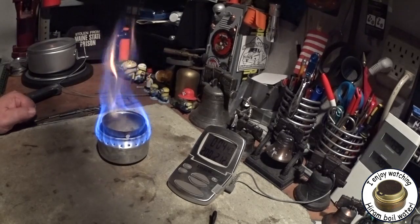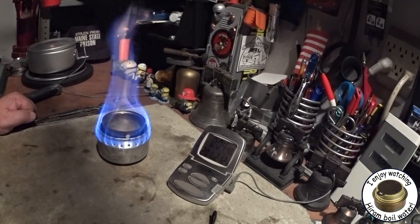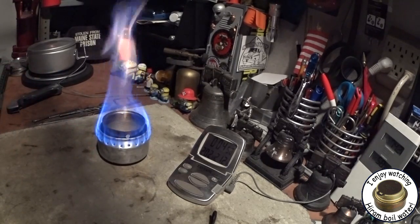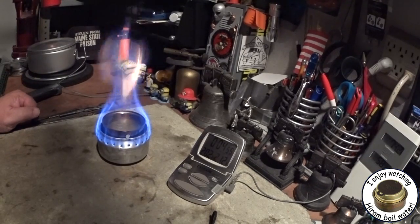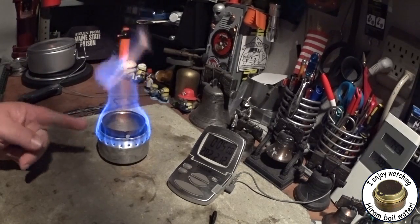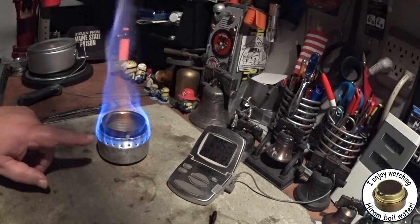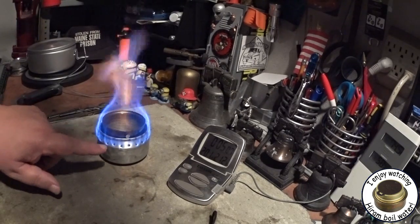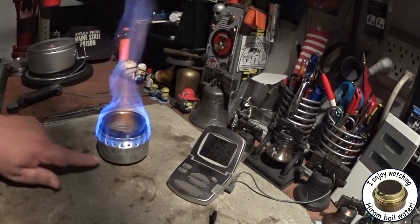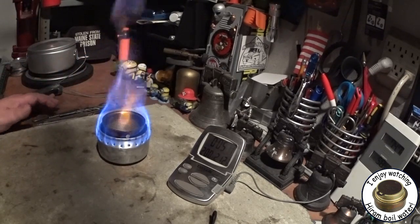It goes back to that same old one-inch sweet spot. I thank NJ Chris for the stove and John Lord for his suggestion to either raise the pot or lower the jets — in this case I raised the pot. This might be something NJ Chris can keep in mind when he makes this next time: lower the jets down so there's that one-inch spot. It would still give him a lot of capacity for alcohol, but it would give you that one inch.